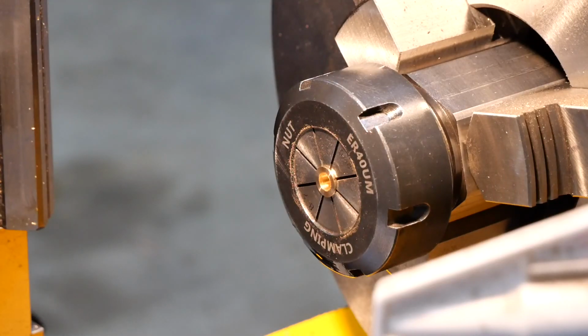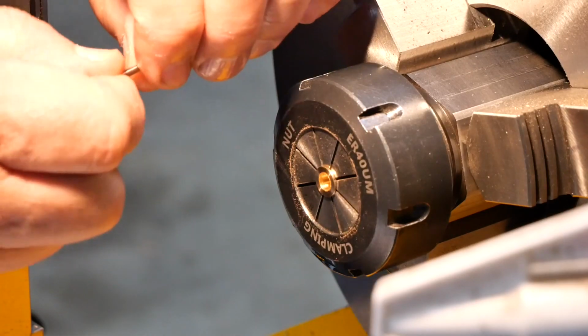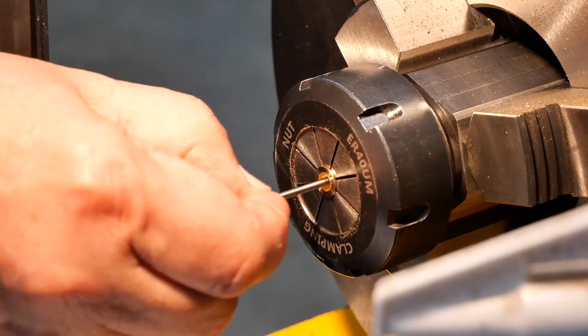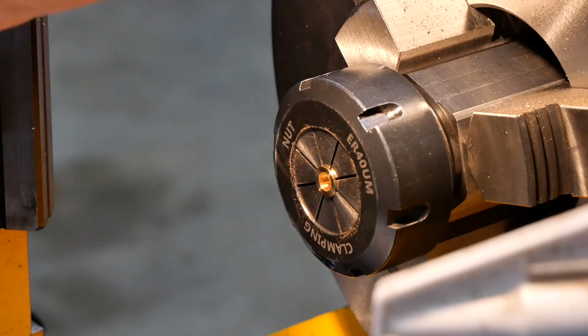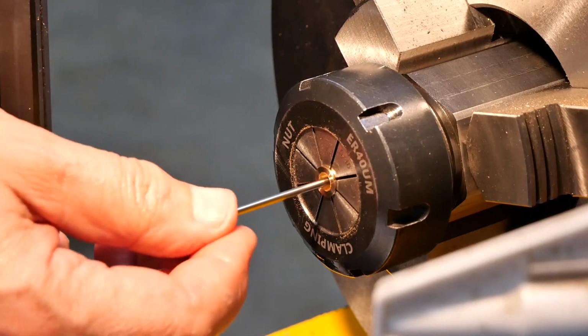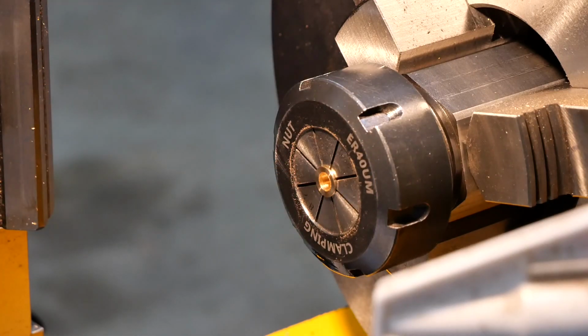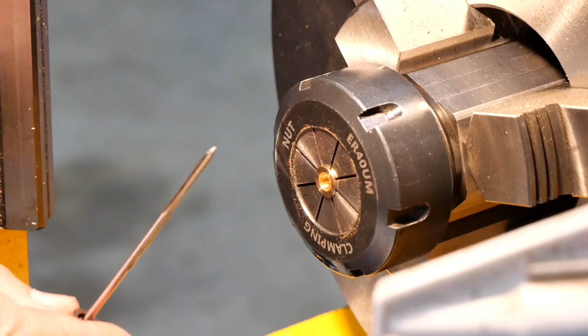It's pretty tight. I think I'll check that hole diameter with a couple of gauge pins. So 332s is 0938. So 093 should go, which it does. A little bit of movement, but 094 shouldn't go, which it doesn't. So I reckon we're pretty much on size, which means Dad's 70-year-old reamer came up trumps.